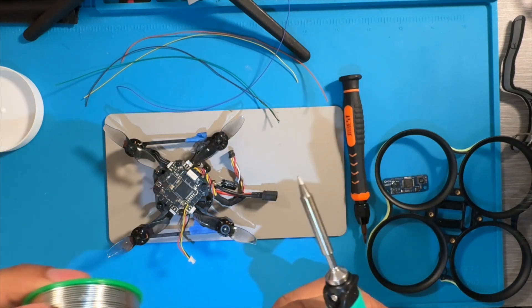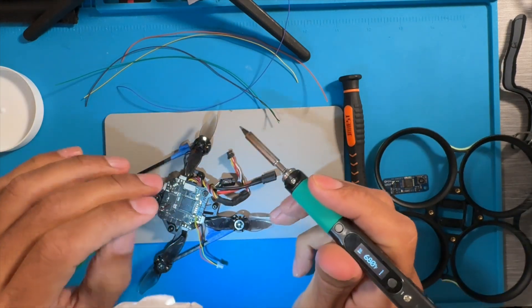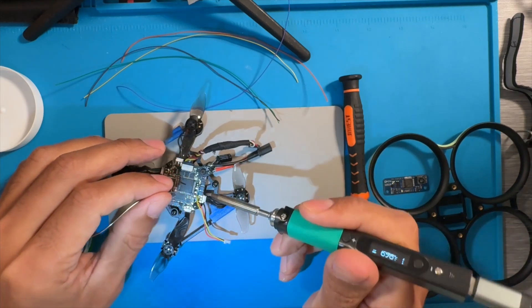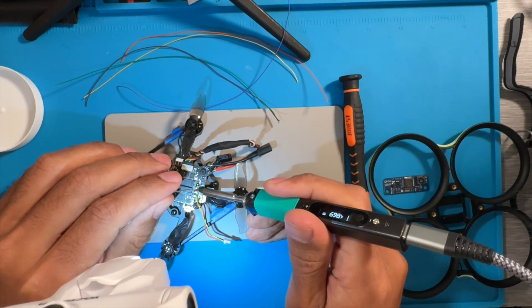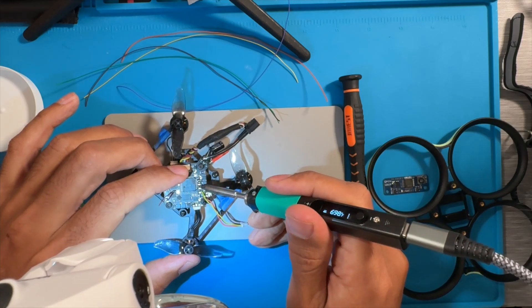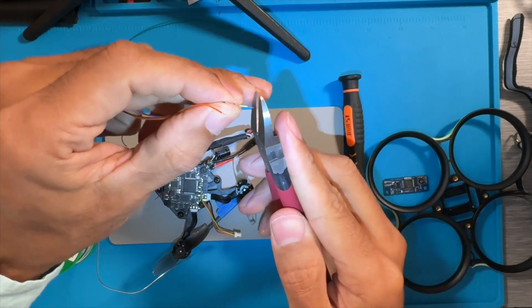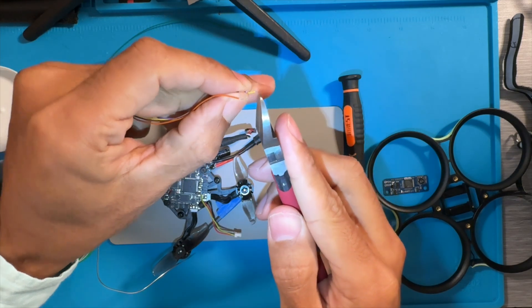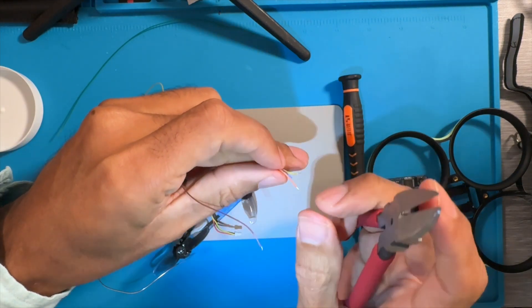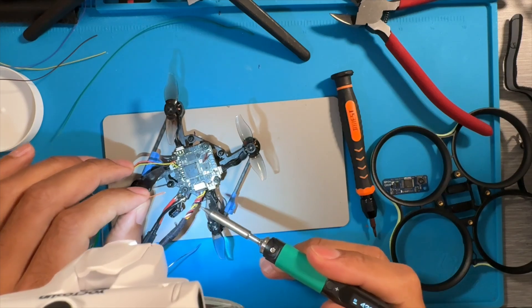And this soldering iron — the pencil soldering iron, as I believe it's called — it's just phenomenal. I think I paid 40 bucks for it. It does everything that the big robust soldering iron does, except you can actually take it along with you and attach external power to it. As you can see, I'm just adding solder to the connectors, to the points that need to be. Once you have solder at the points that are going to be soldered, you want to clip your wires. After you've clipped your wires, don't forget to tin them — you want to tin your wires so that helps with the connection and solidifies things. The wires have to be snipped really short.